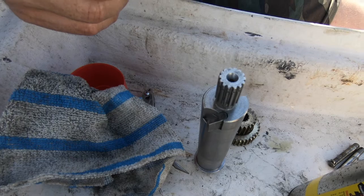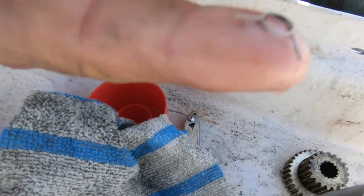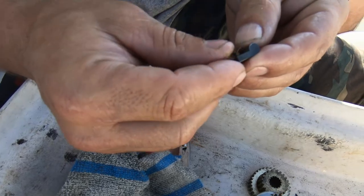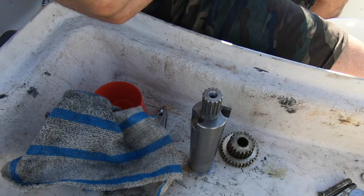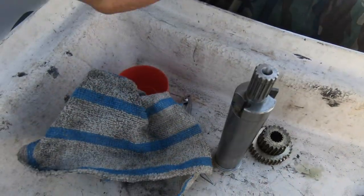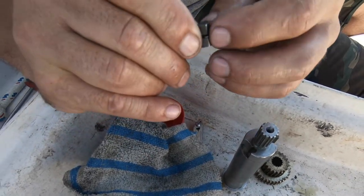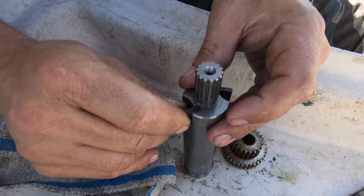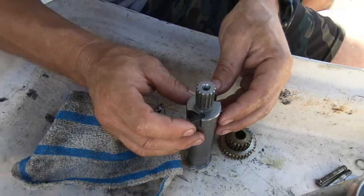Should I tell the secret? What's the secret? The bent side goes away from the pawl, past the side that meets here, so that it sits flatter there. The trick is to get the spring in there, hold it with your thumb so that it's sitting inside the radius as close as you can. Then you can slide it right in and let it go — just like that.